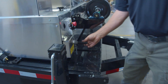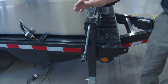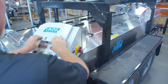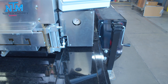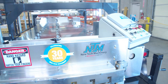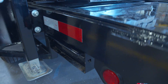Now let's talk about safely transporting your machine. Make sure your width adjustment is locked in place and your trailer jacks are all the way up. Make sure your computer is closed up — there's also a lock that goes with it. Make sure your cables don't clop around and are tucked underneath nicely. All your safety latches should be latched all the way through the machine — walk around and make sure all of those are attached. If you pull out the catch tray and dump it, make sure it's got the latch on it — pull it in and make sure it's latched all the way so it won't come out during transportation.